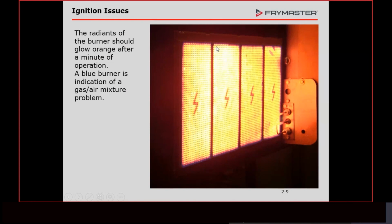This is the color that you want to see inside those sight glasses, a nice bright orange. This can be very confusing sometimes for people, because most people relate the color of the flame from natural gas to blue. There's even a blue flame award that gas companies give out for innovations and new ideas to make equipment more efficient. Our burners create an infrared color because we have that air blowing in there.